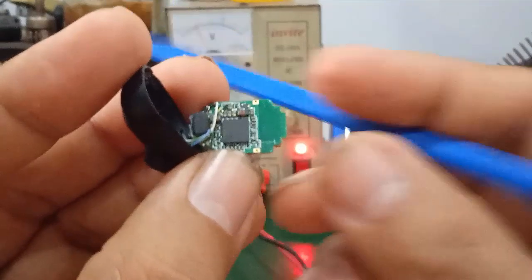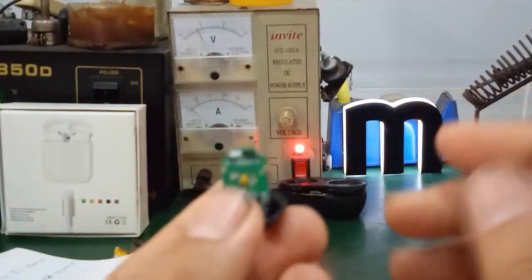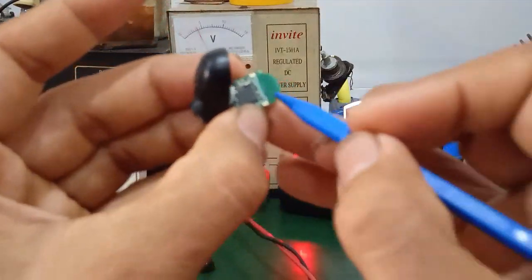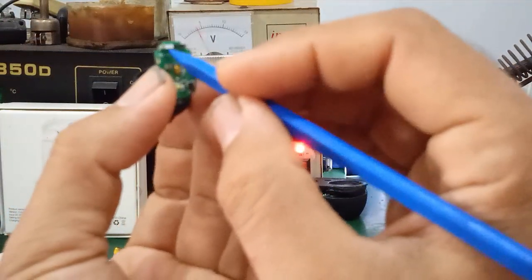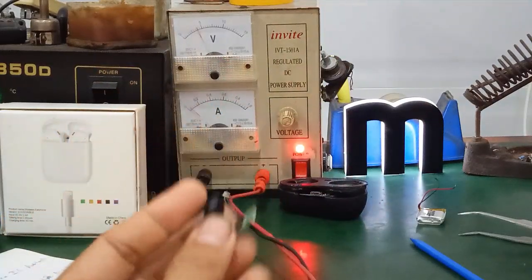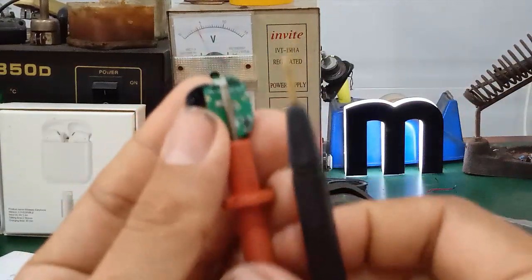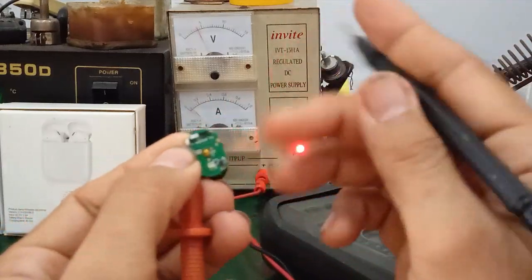Check the output — look at the circuit board. The antenna has two ends — do a continuity test. Also measure the output of the antenna port — notice there is a trace here. Do a continuity test at the antenna end to see if there is continuity. If it's broken, you need to use a wire to reconnect it. This is a common issue because when people use earphones and drop them, the antenna pad can come loose or the capacitor/resistor components between the antenna trace can fall off, causing loss of Bluetooth connection. You need to disassemble and resolder the trace.